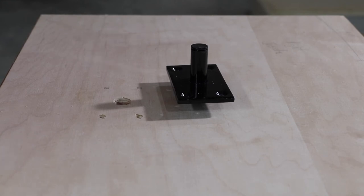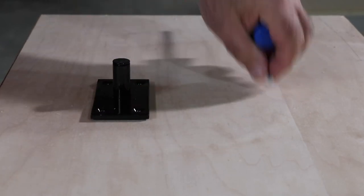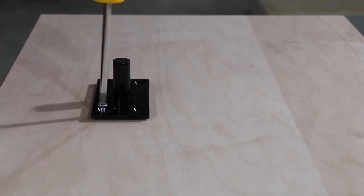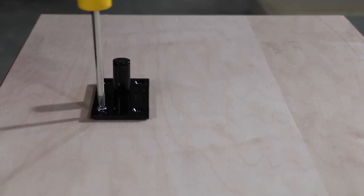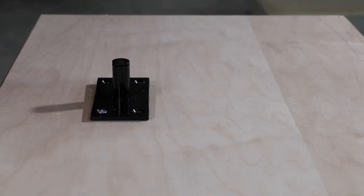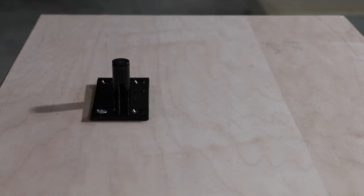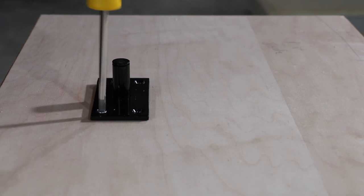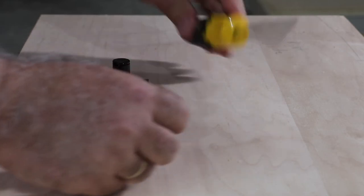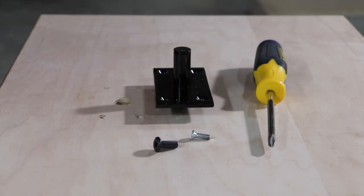We had to drill the partial hole carefully — you need to make sure you don't drill out the other side because that would be visible on the outside of the cabinet. Those two holes are for the T-nuts and that gives it a lot more stability. It works fine with only two as the instructions show, but I think if it were me I would have had all four be T-nuts. I should mention that before I finished the bed I took all the hardware back off so it was easier to stain everything.